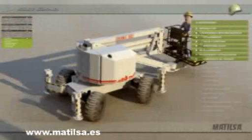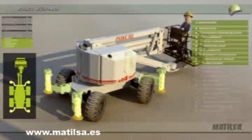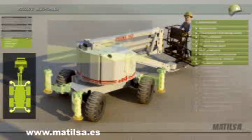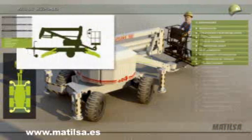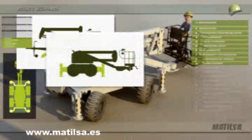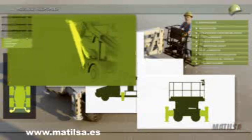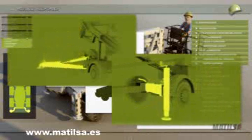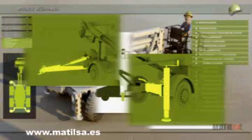The stabilizers are just auxiliary supports that help to give more stability to the machine and to allow leveling when the machine is off balance due to the nature of the ground. It is very common to see them on different kinds of platforms. Trailer-mounted machines, self-propelled with tyres, or crawler type. They may be flapped, telescopic, manual or automatic, depending on the weight of the machine. Its geometry, sideways transporting and the load in the basket will vary according to the supporting surface.